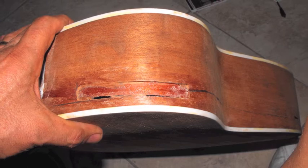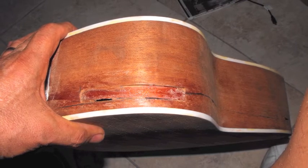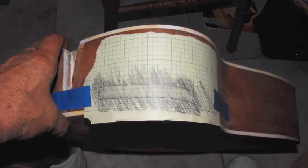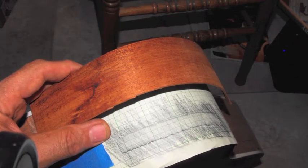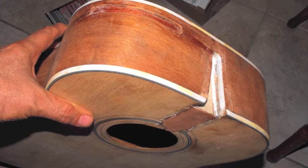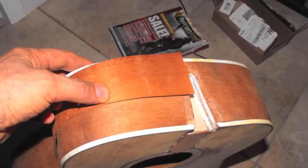What I did was I took my little Dremel tool and that big gaping hole was all jagged-edged. I cleaned it up. I put a piece of mahogany behind it and then I took the Dremel tool and smoothed out the edges as best I could. I took a piece of paper and traced it with a pencil so that I can lay that piece over another piece of wood. I've got some bent mahogany wood that I got from my buddy John Hall over at Blues Creek Guitars. I'll mount that paper template on the piece of wood, cut that piece out a little bit bigger than the hole, and then carefully sand my way down into that piece of wood to get it to lay right in there. Then it'll be just a touch-up with a little wood filler and some sanding — it should look pretty nice.